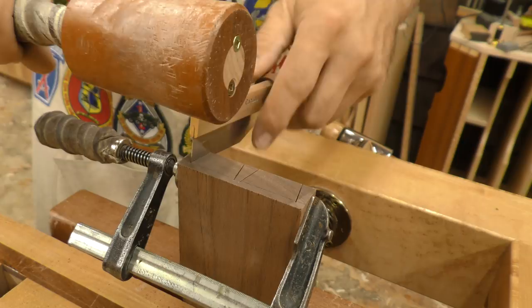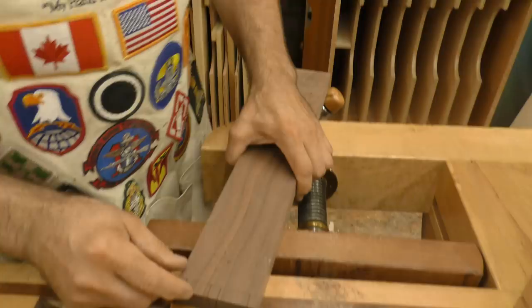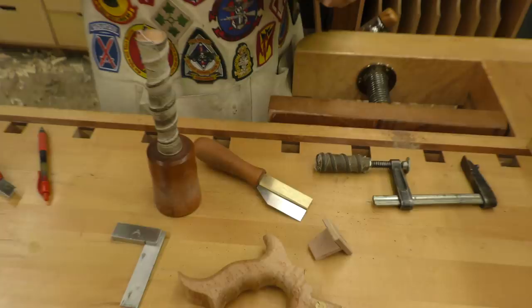Now we'll go right to the back. The only task left is to remove the waste, but as I chop away this waste, I don't have to go in and pare the sides of either of the pins because it's already been cleaned off with the Curf X10. It's actually amazing. Works in hardwood, works in softwood. The only precaution is on that outside half-pin — offer a little bit of support to the wood just in case, to prevent it from splitting off. That's the Curf X10.